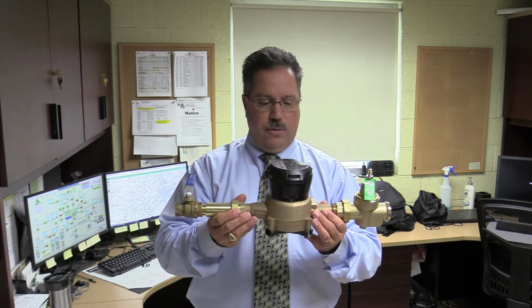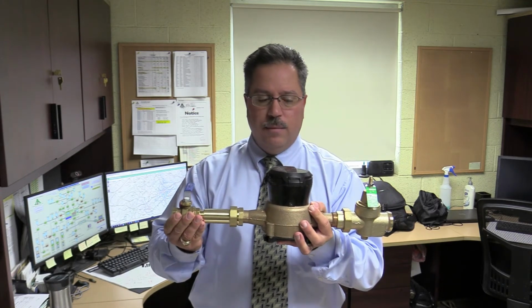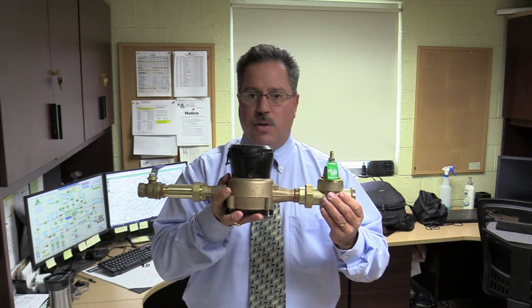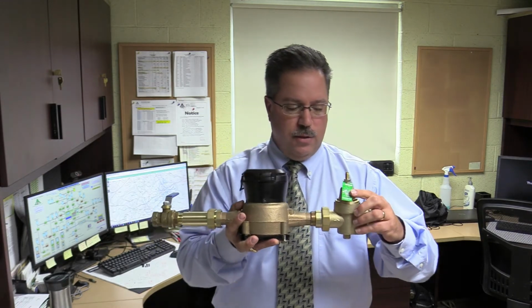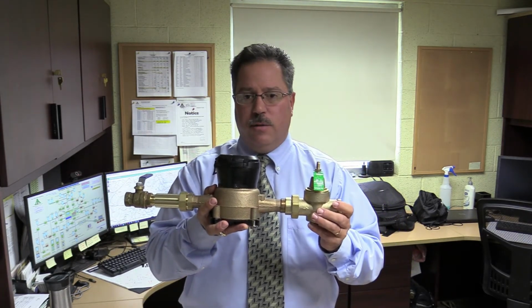with flow issues, what's called a pressure reducing valve. We have a meter, we have a check valve, and we have a valve. Pressure reducing valves, in this case, this is a standard pressure reducing valve in a residential setup. And as you can see, there's a little tag on the front. In this particular one, this is a range from 25 to 75 pounds pressure.